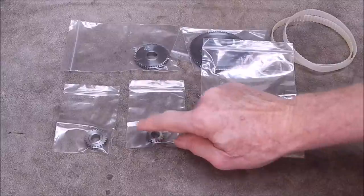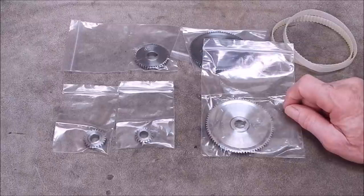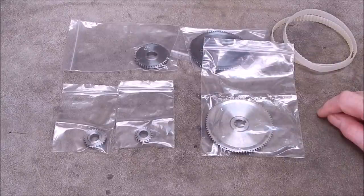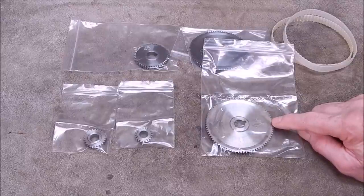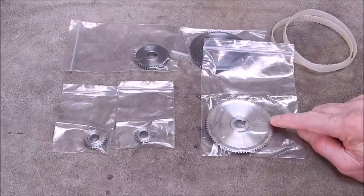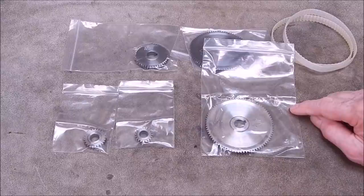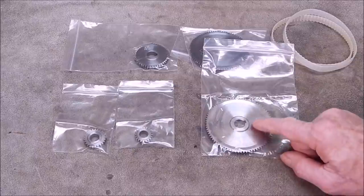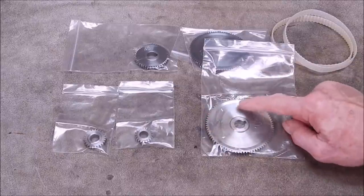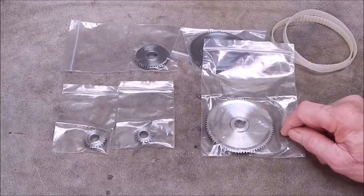And of course, these are your reverse tumbler gears here - one's a 25 tooth, one's a 20. I'm not going to fit all of them, because as I said previously, these little lathes don't have a shear pin or provision for a shear pin on the lead screw. If you use all metal gears, I think that's going to be an accident waiting to happen - something's going to break that shouldn't break. So you want to leave at least one plastic or nylon gear in your gear train. If things go pear-shaped, it's better to shear a tooth off one plastic gear than break something much more serious.